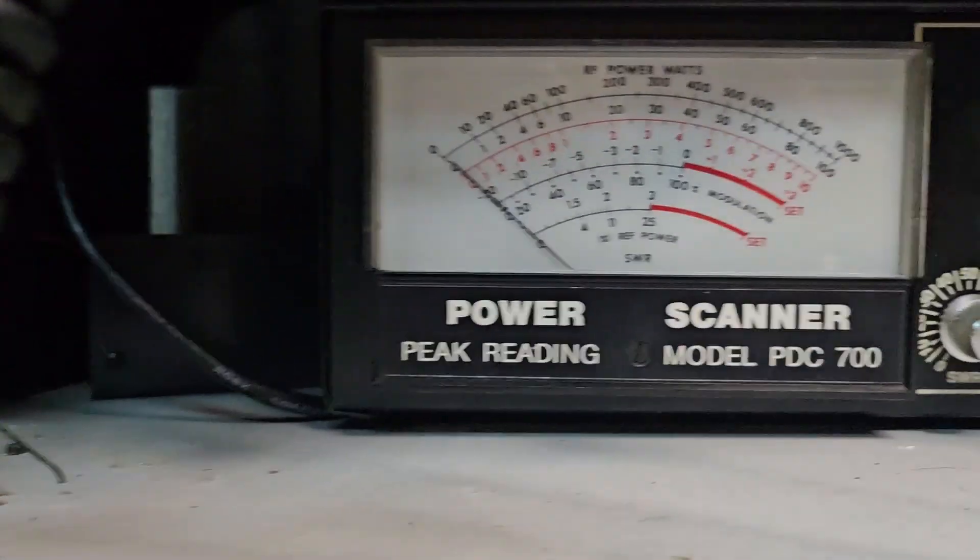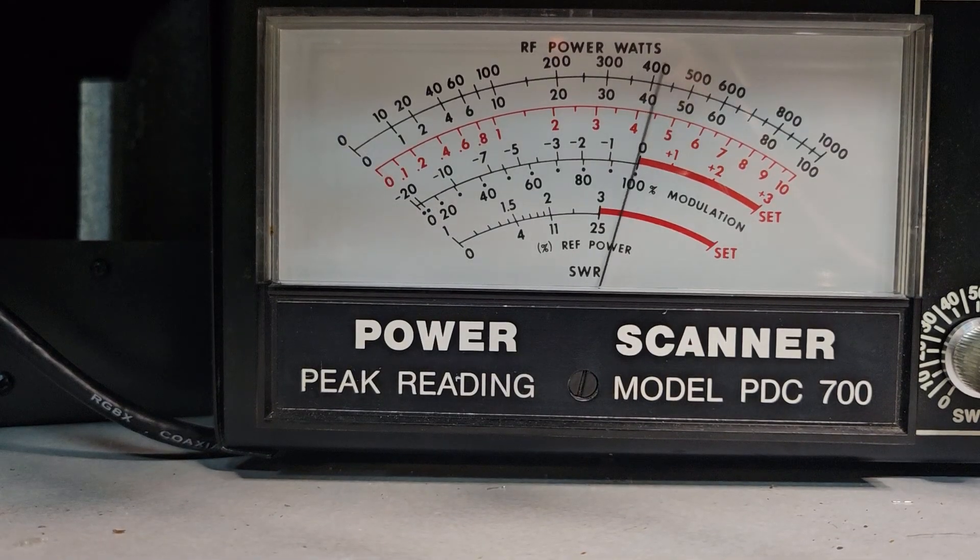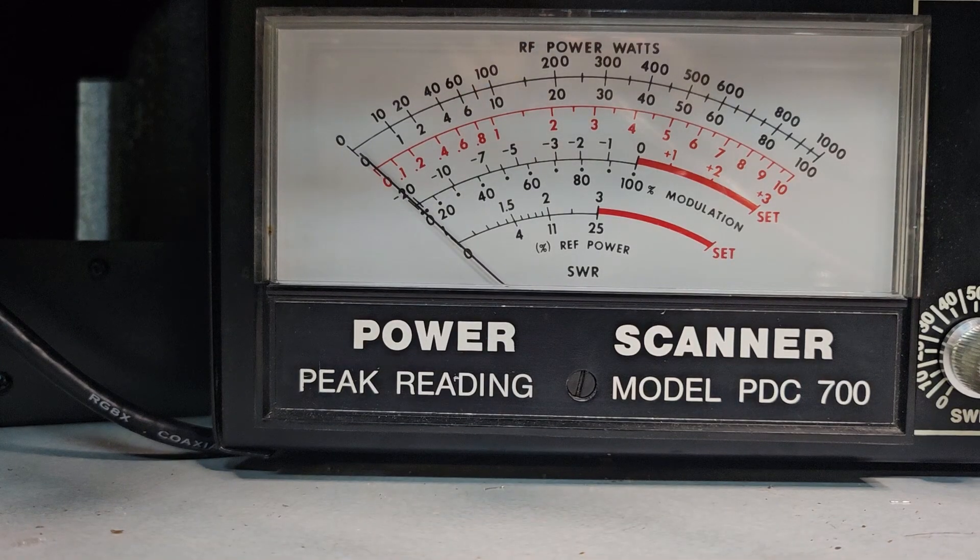On 20 meters FM, doing a mic test, you can see on the meter we're about three and a half to four watts. Let's go to 40 and see what it's got on 40 FM — about a watt and a half on FM. Then just for giggles, we'll jump over to sideband on 40 meters and see what that looks like on the meter. There's a little bit of a power drop on sideband. Let's try it on 20 meters SSB — maybe that will get us the full five watts this radio claims.